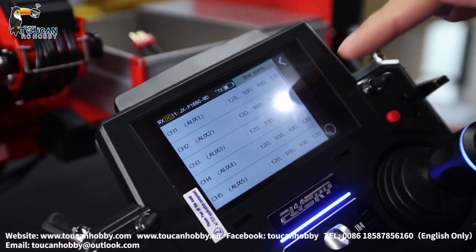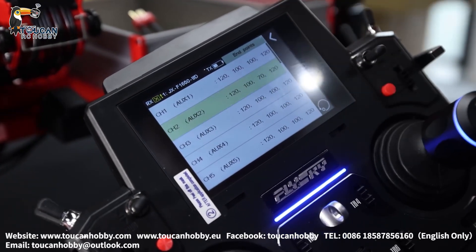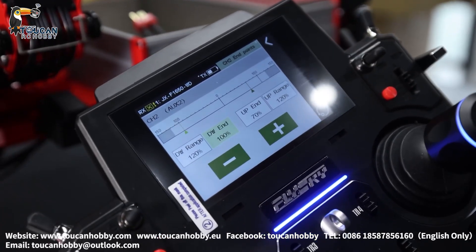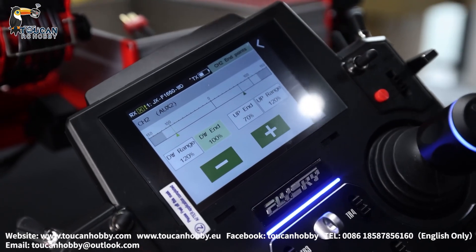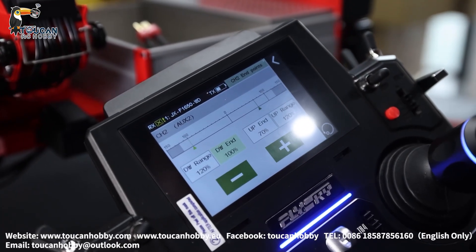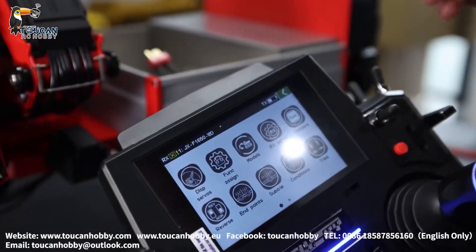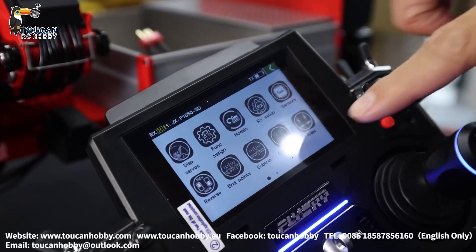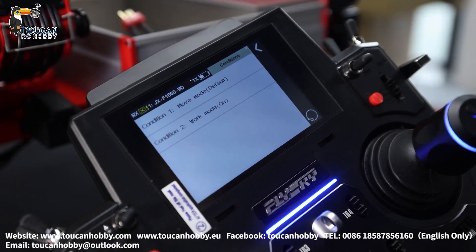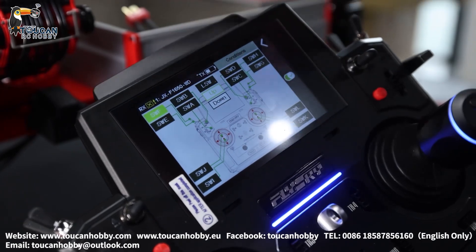Now at the end points, I'm setting CH2 for the pump at 70%. Quite a high load, but the pump is modified with an ESC. The pump is running at low speed because the crane has very small holes, so 70% is still running and not too much load. All others are at 100%.